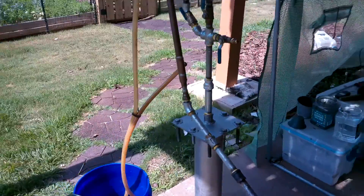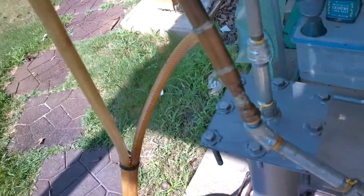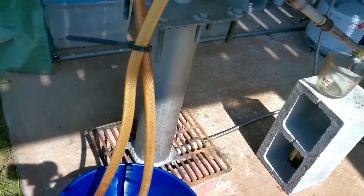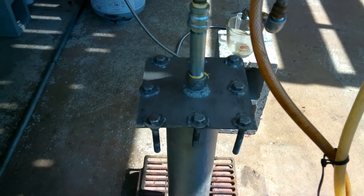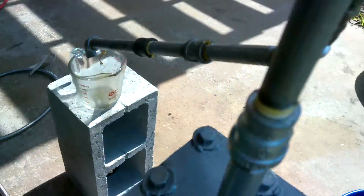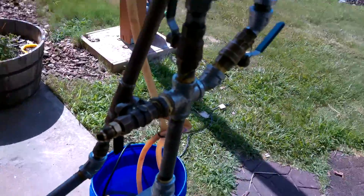The coil bucket was kind of ghetto, I won't lie. So I replaced it with my liebig condenser. Before, I didn't have my liebig system plumbed together - I actually had to buy a whole new pump because my old pumps didn't have the proper specifications. But as you can see, it looks really good in the end. It's nice and airtight welded, I put some silicone between it, and this thing could be a pressure chamber - it's more airtight than my reactor, which is exactly what we want.